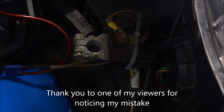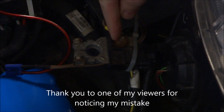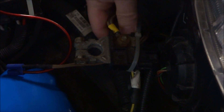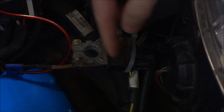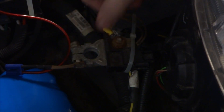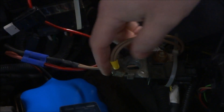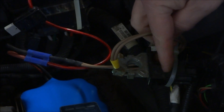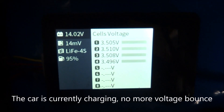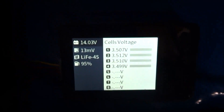I needed to do a little update to this video. I connected my negative lead to the connection here but what I didn't realize is that it actually bypasses the current sensor — it connects directly to the negative cable. It's very important that all the current coming and going from the battery is monitored by the current sensor, so I had to remove it and make a connection on the other side. Now with the connection in the correct location, all current going to or from the battery will be sensed properly, and the meter does seem to be working correctly — the voltage isn't bouncing anymore. For anybody wanting to do a similar modification, make sure on the negative terminal you make the connection on the correct side. Thanks for watching — until next time.